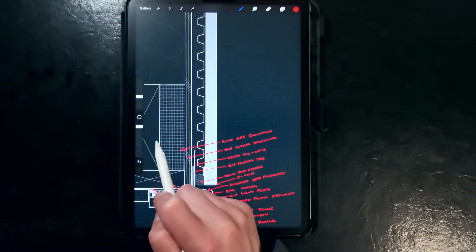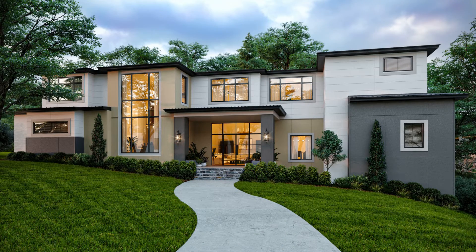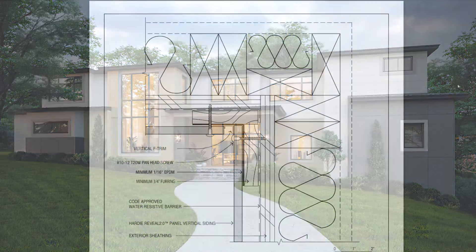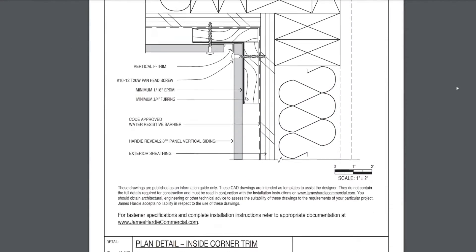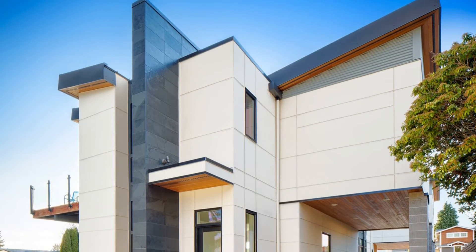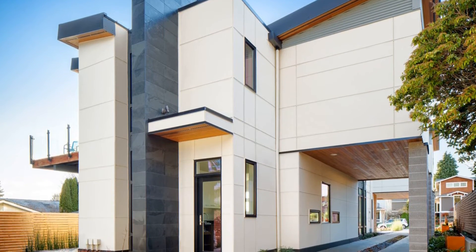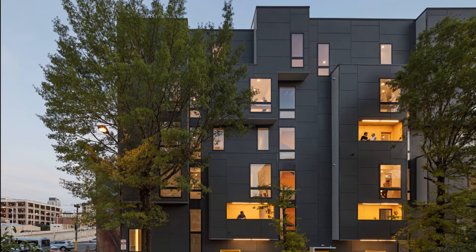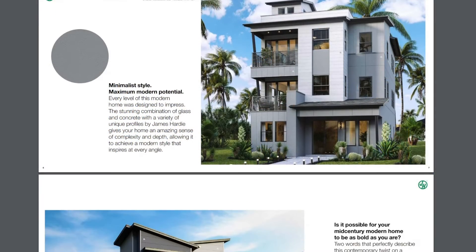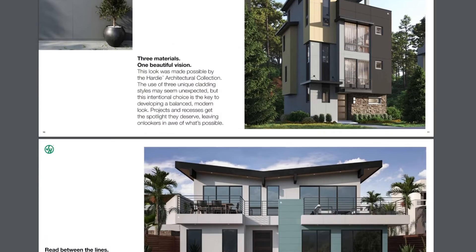If you're still concerned about the water problems associated with stucco, James Hardie makes a fiber cement board product called Reveal from their Aspire collection that almost looks indistinguishable from stucco, especially if you use a textured paint. It's a panel system installed similar to traditional siding over rain screen battens to provide a drainage plane, and then mechanically fastened to the wall system. The benefit is that it simplifies the wall assembly and installation, which can be beneficial if there are concerns about the quality or skill of workers in your area. Most builders or contractors with a small crew should be able to work with this product without needing a stucco or siding contractor.